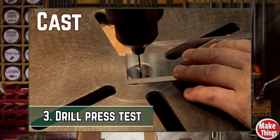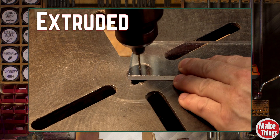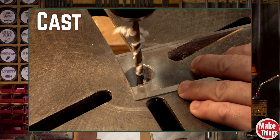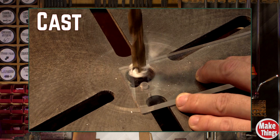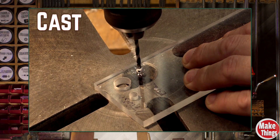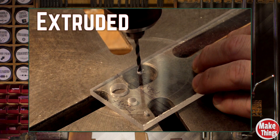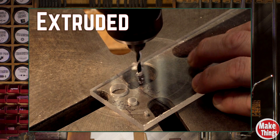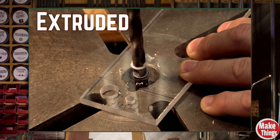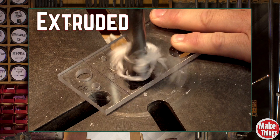Cutting plastic is ugly at best, but the real problem is when you need to attach it to something — so we're headed to the drill press. We'll start with twist bits: a 1/16-inch to see how small flutes handle the cut, then a 1/4-inch which is about average size, and we'll finish with a 1/2-inch bit, big enough to make things interesting. Next we'll use what I think is the worst bit for plastics: brad point bits — not because they grab, but because of the spurs. We'll start at 1/8-inch, step up to 3/8-inch, and finish with a 3/4-inch bit, the one I use for cutting dog holes on my bench.